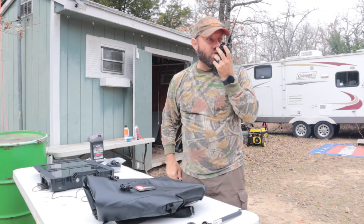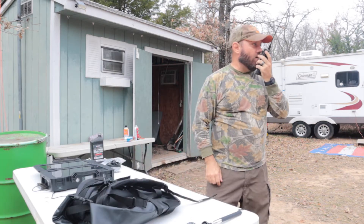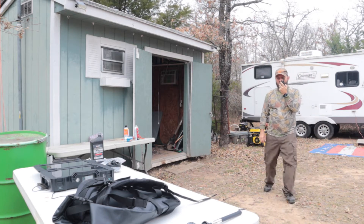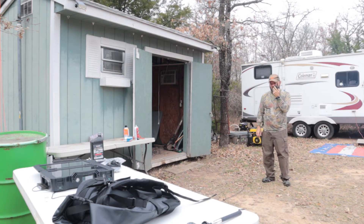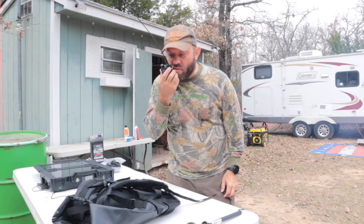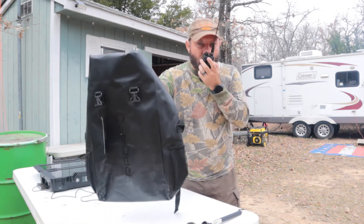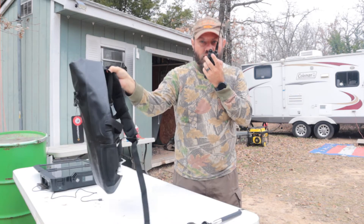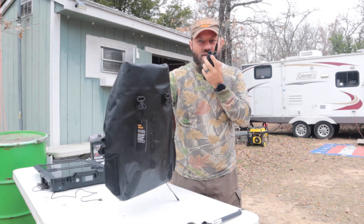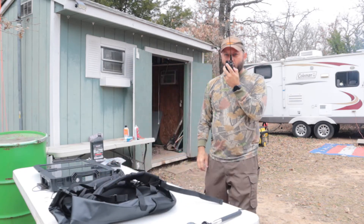That does work. Okay, so now I get just a little bit. If I'm right next to it, you can hear it, but it's real distorted. There it's blocked, there it's not blocked — but I'm right next to it. So if I get out here and move back a couple feet, the signal's gone. It's all distorted when I'm close, and completely gone when I move away. I'm two feet away from the bag right now, transmitting five watts into a radio that should be hearing it plenty.